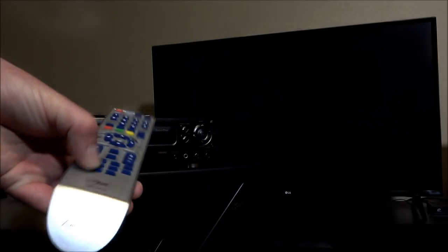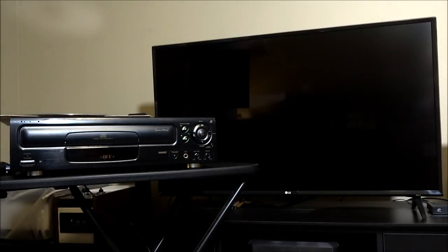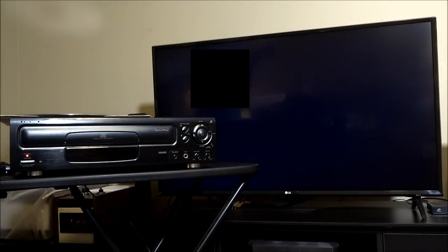We'll hit the same two buttons, but this time in reverse order. So it's going to be test and then ESS. Everything will go black for a second, but you'll see it come back to its normal, proper state. So let's do that. And there we go. And of course, you can shut off the machine. But it's just as simple as that. Simple by AV Geek standards, anyway.